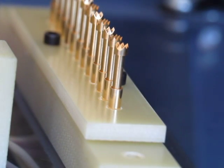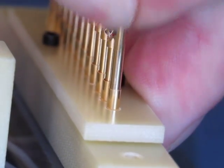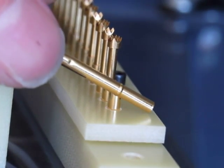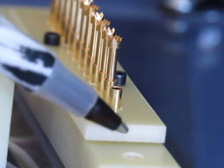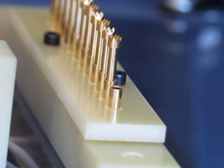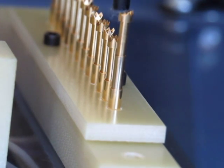The pogo pin consists of two parts: the pogo and the socket. They come apart like this. The socket has a shoulder on it. This plate holds the shoulder down — it sits on top of the shoulder, holding the socket in place. To reinsert the pogo pin, always use a plastic tool to prevent damage to the pin.